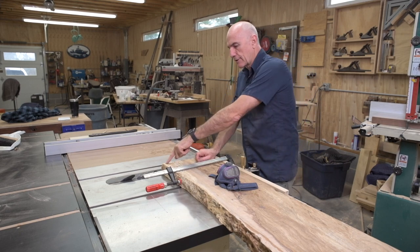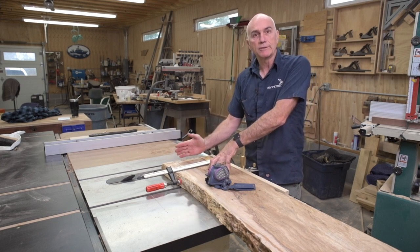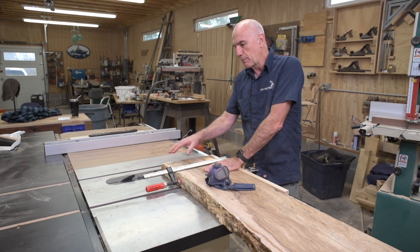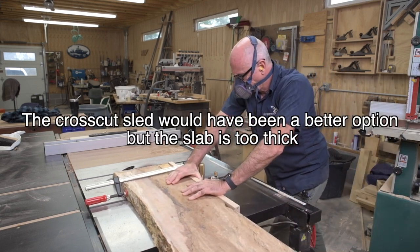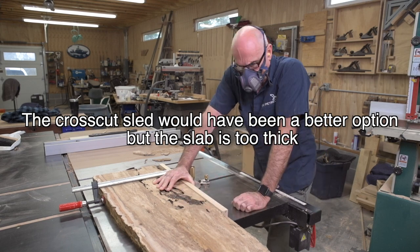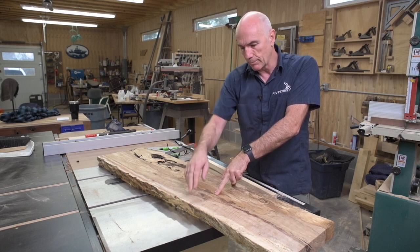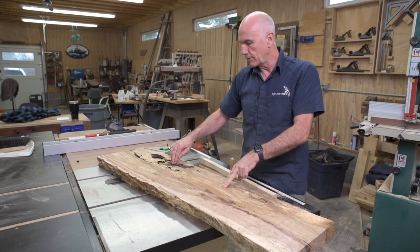I'm here at the table saw and I want to cut the ends nice and square to the edge where I cut off the live edge on the backside of the bench. I've got my miter gauge set up with some scrap clamped to it — it just barely fits, so I'm going to have to start it, then raise the blade and go through. I've been trying to decide which end to flip to 90 degrees, and I think I'll do this side — the live edge has a better chance of lining up. The wood is pretty solid over there, but on this other end I'd run into a little bit of rot.